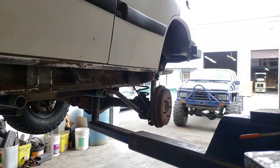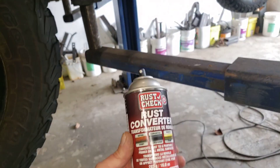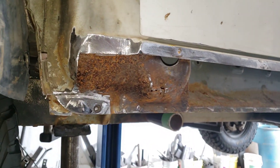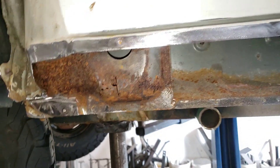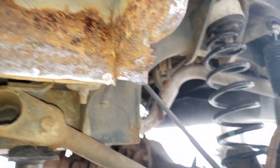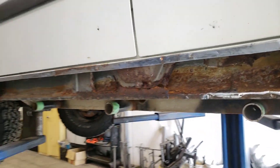While I go over to the other side and start cleaning it up the same way, I'm going to spray it down with some rust converter — this is by Rust Check, but other brands are available. I am certainly not sponsored. Rust converter is a great thing to spray on there. It's a chemical conversion — what it does is it changes red oxide to black oxide, which is kind of like changing a malignant tumor to a benign tumor, in that it will no longer spread and grow.